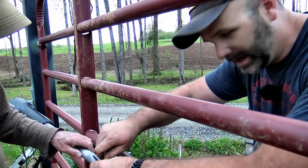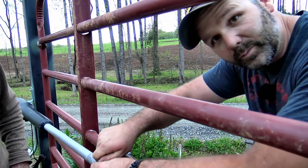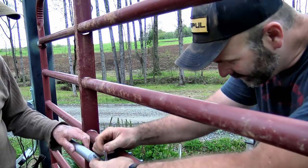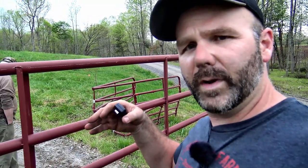Also, if your gate fails and you're headed to work early in the morning, this is something you can lose when you need to unhook the gate and open it manually — which happens sometimes. Now we're going to hit our Mighty Mule gate opener, but we've got to watch it really close right now because the limits aren't quite set yet. I'll show you how to set the limits so it closes firmly and opens to a certain point. This design — if it bumps into something, it'll move back either two or four inches.